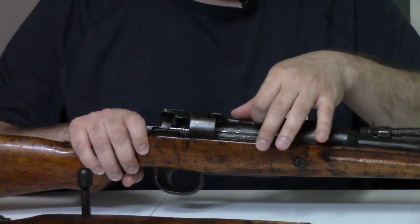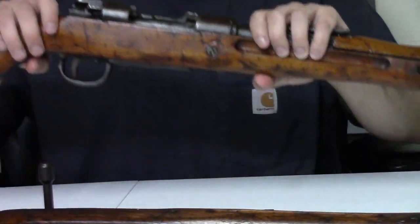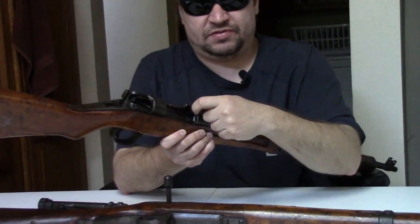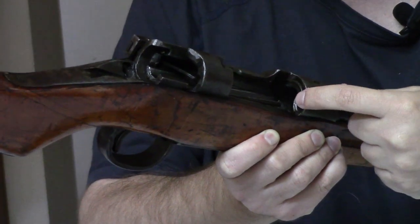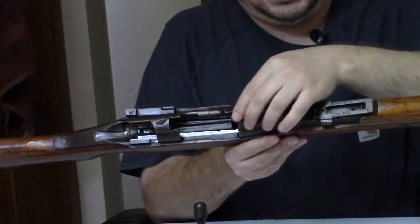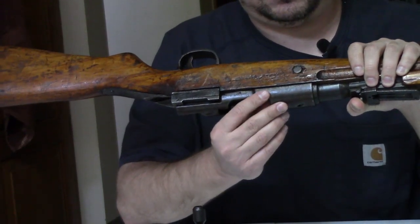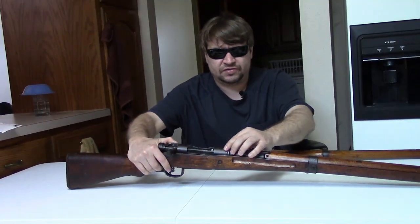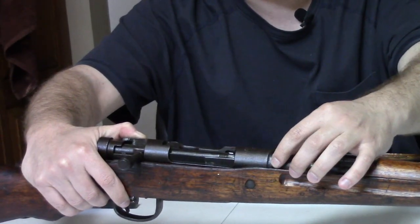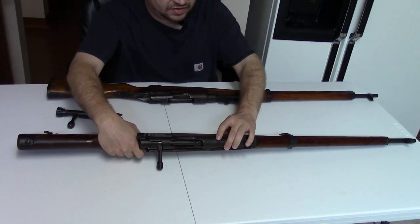Looking into this receiver, it is also cast iron, which normally would not stand up to more than one or two shots from a full-power cartridge. What they did was use a barrel extension — the barrel comes all the way back into the receiver. So inside the receiver is actually still part of your barrel. This is why this receiver is wide, with steps on each side where it flares out to accommodate the barrel extension. On the standard Arisaka you'll see a much thinner receiver because that's a steel receiver and the barrel just screws into it.